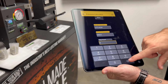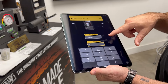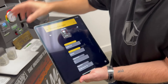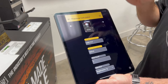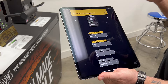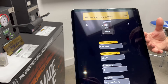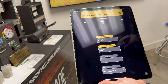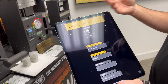If you change it to one bag and still want 650 material PSI, because the surface area is less you need to put half the actual gauge PSI to put the same exact pressure on the material. That's why this calculator is so crucial. Any extract alchemist needs to know what material PSI they're putting on the product. Too much pressure mixes everything together and causes blowouts; just the right amount gives you a great result, and more importantly lets you repeat those results time and time again.